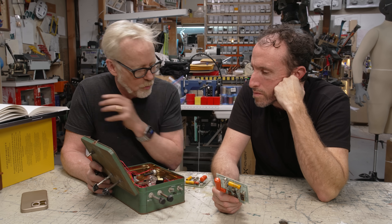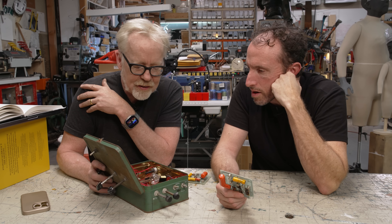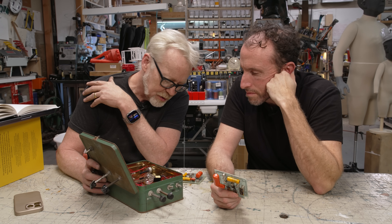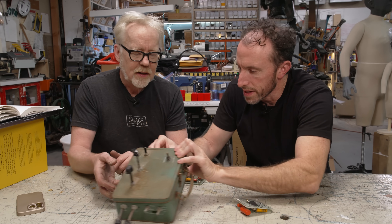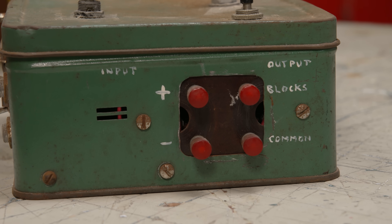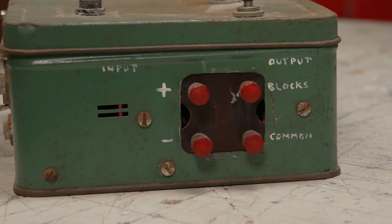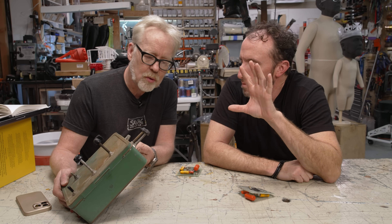Everything about this says to me it's from old RC equipment, potentially. But I'm curious about where the transmission happens. I don't think this is actually RF at all — I think you might be doing pulse width modulation of a motor. That's why you have 'output' — input and output. These are screw terminals: you put your wire around this and tighten it. So this is all about controlling a motor — forward, reverse, throttle. This is a pulse width modulation motor controller.